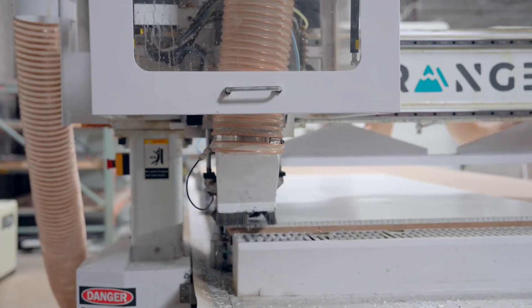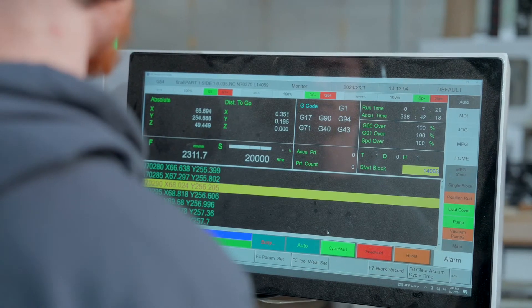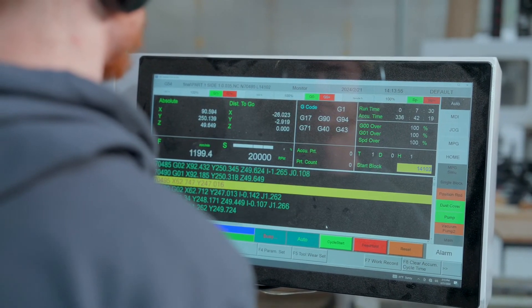The quality control process is very important, and I think that's one thing that really sets us apart, especially at this price point. I don't think there are many companies that are lasering the machines — and when I say that, I mean for compensation tables within the controller — essentially spreading out these values over the entire table. It's a really pretty advanced process.